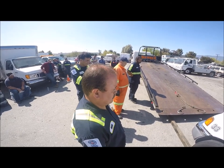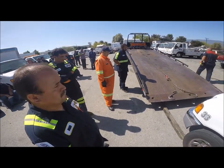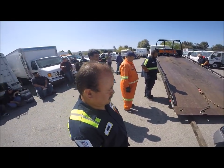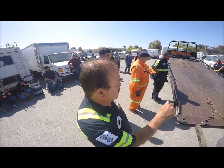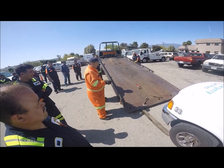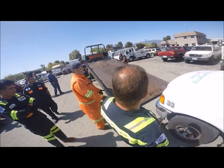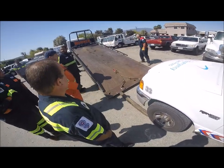Air suspension on the rear would be a must on the next truck — I do like the dump suspension on the rear, you can drop the angle a lot better. They also make LCGs that bring it down a foot lower. Get used to planting the bed, because when you go to take cars off if you don't plant the bed, the weight of the car will cause it to sit on the ground and when the car comes off it'll kick up. So get used to planting it on the ground.